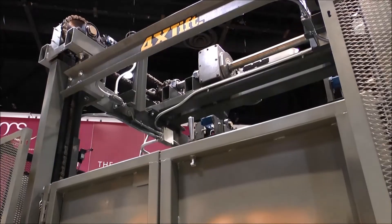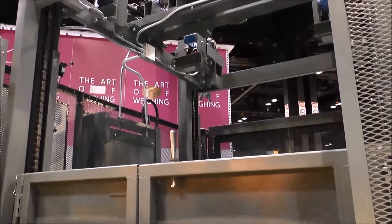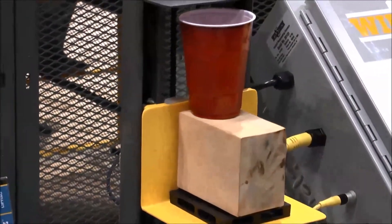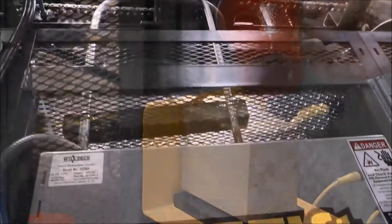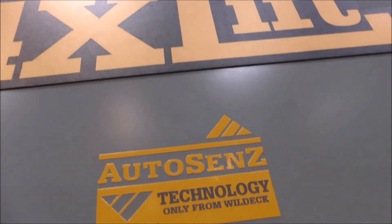When you're lifting heavy loads, that kind of safety device is very much in demand from our customers. When a load is placed on the carriage of the lift and it is moved up to the next level, if it jams anywhere along the way, the AutoSense control will sense the change in motor current from the mechanical lift and will stop the lift in its tracks, saving both the material that's moving up and any wear and tear on the lift itself.